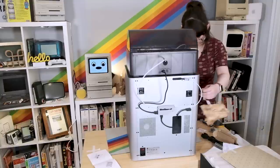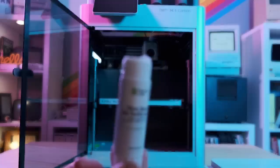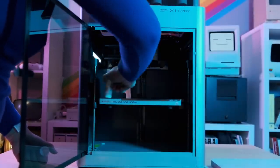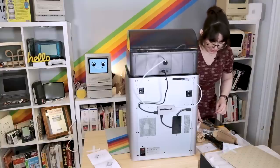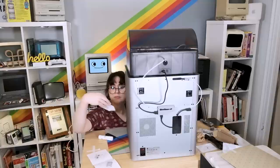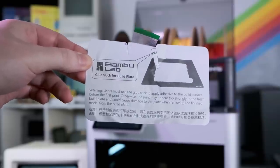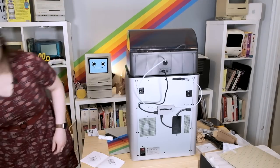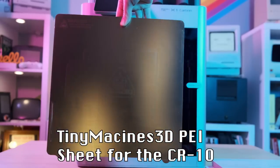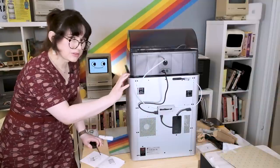Let's see what they gave us in this egg-crate package. A glue stick — this acts as a sacrificial layer. You apply a layer of glue on the bed, put your part on, and when it's done you can easily remove it. It helps with removal, not adhesion. There are also some hot end parts — it came with an extra hot end, which is cool. The note says: warning, users must use a glue stick or else the print may adhere too strongly to the build plate and could cause severe damage. I personally love PEI sheets as my build material and may get one cut to the 256 by 256 size, but I want to keep it stock for now and see how it runs.